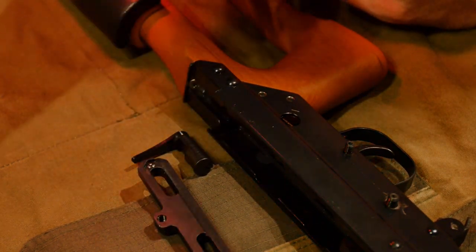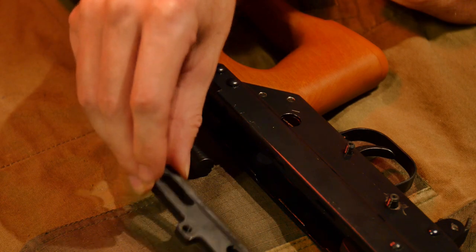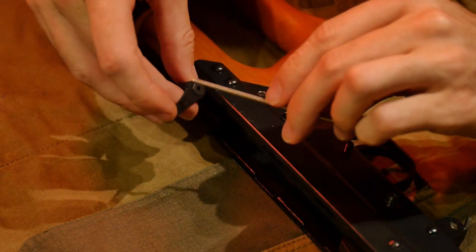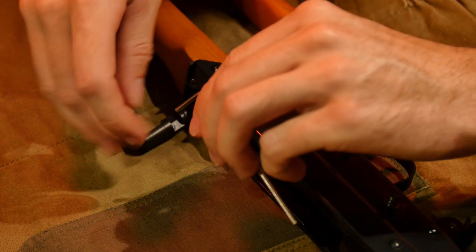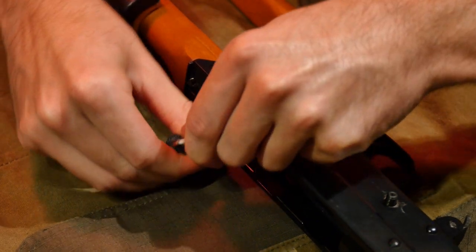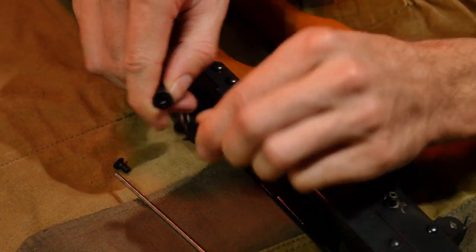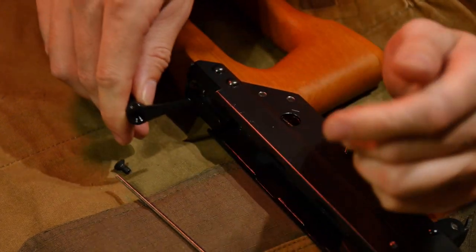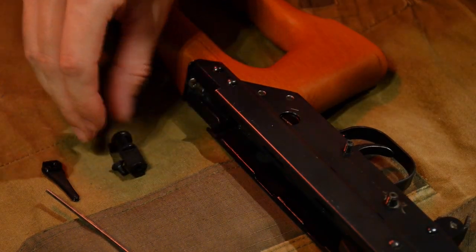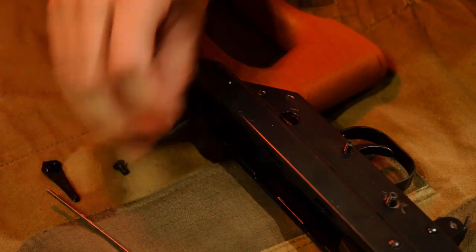You could actually install your ball detent into your side rail with that shim underneath it if it warrants it, and then push it off to the side. After you've squared that away, you'll want to remove this plastic paddle using your Allen key — it's not Loctited, just torqued against the plastic, so it might be tight. Be careful pulling it out — you don't want to snap it off because you might need it until you can get your LCT paddle. Once stripped down to just the raw cam, the next step is to install it into your firearm.